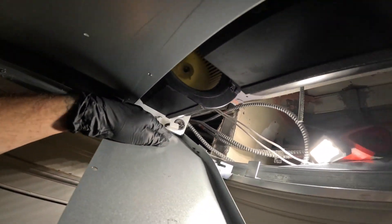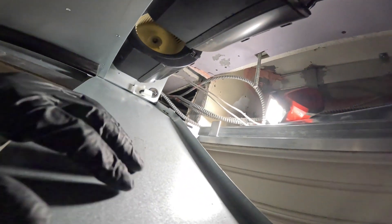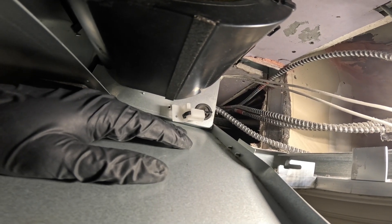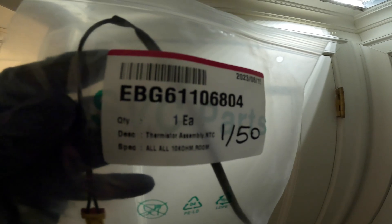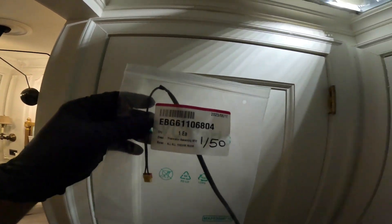Let's cut this ceiling open — still don't have proper access. I just cleaned everything in here and changed the motor and the motor back there. The air sensor is right here in the blower section — this thermistor right here. There's a screw here but I had to take it out to mount that motor. We have an original part and this is the air sensor. This reads the room temperature — it's pulling in the return air and that's going to give you the most accurate reading.